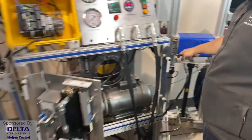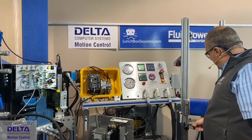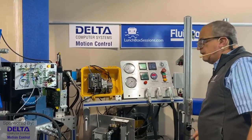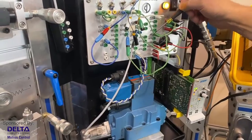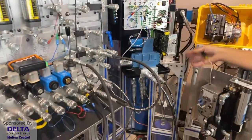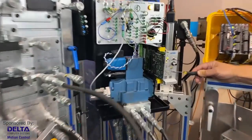And that is attached to our cylinder motion, and that's going to provide feedback. So that cable encoder, that displacement transducer that is cable pulled, is connected to our amplifier card. In this case, we're using connection D6 because it's current that we're sending in, and that creates a complete closed loop system. Now you'll see these three factors for tuning.